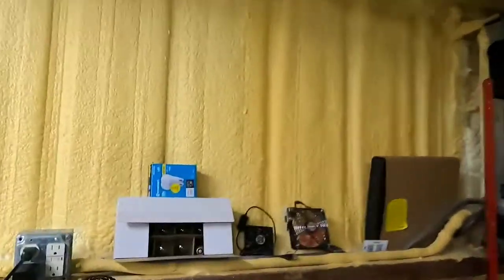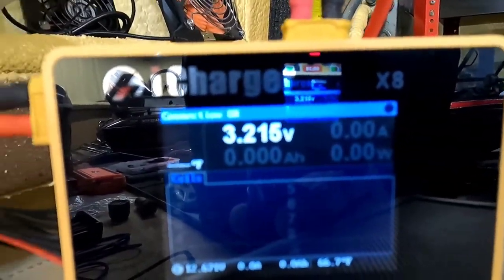I've removed the battery from the light because it's no longer able to run in the three primary modes — it won't run on high, it won't run on medium, it's de-rated down to the low level. The question is: what voltage is the light programmed to cut off at? I stuck the battery on the charger and we're at 3.2 volts. That's the voltage cutout — that's a proper cutout, and it matches what we had set during our capacity discharge test.